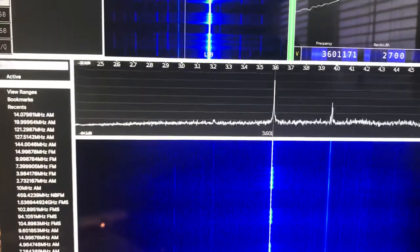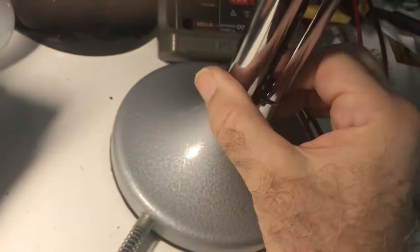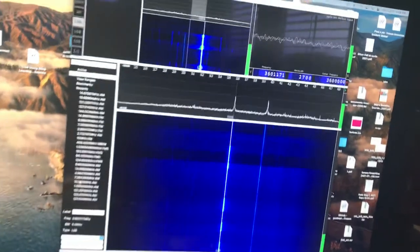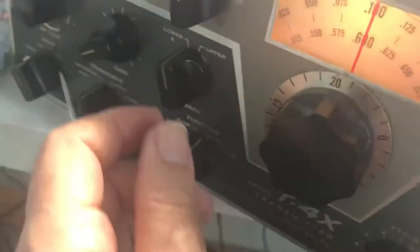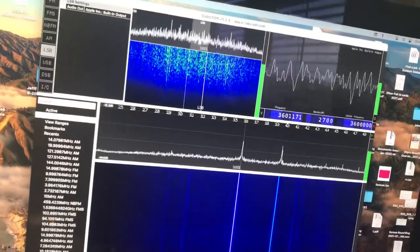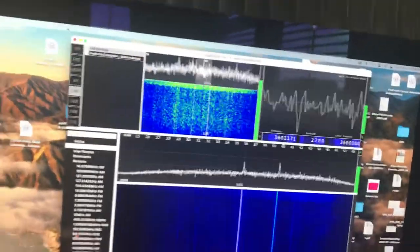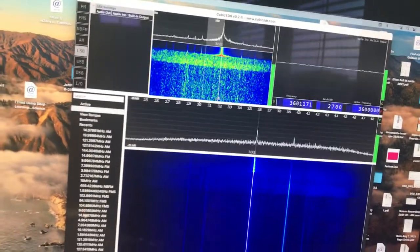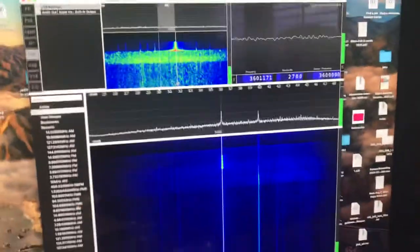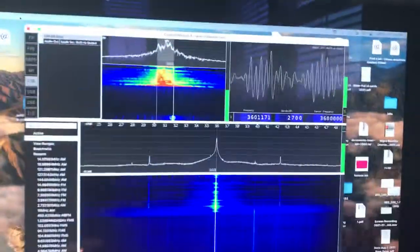The more precise way is to listen to the sideband itself. We can put the mic back down to unlock it and actually listen to the sideband. I'm on lower sideband now. If you get the sound to be equal on upper and lower with the SDR, you're on the money. There are the sidebands, there's the sound. Testing one, two, three — that's about reasonable.